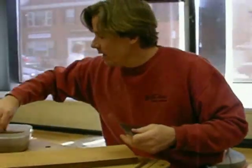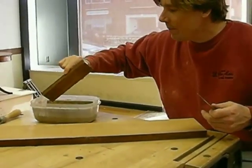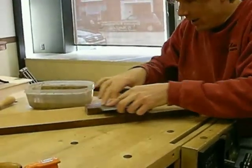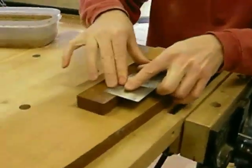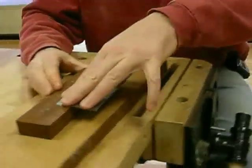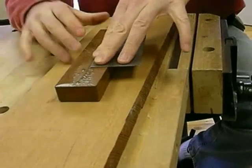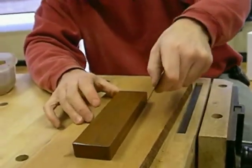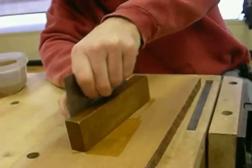So this is just a block. I take one of my sharpening stones — a water stone. How's the water? There's no R's in New England! So you see what I'm doing here, buddy? I'm just taking the junk off. I have it on a piece of wood because I don't want to stain my bench. If you don't want to wreck your stone, you can kind of put it on the side of it. It's just to take the burr off that the file created.